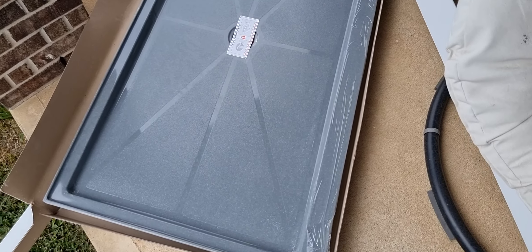You can see the waterproofing flange here — also called a tiling flange, those names are synonymous — and it goes all the way around the base. There's a curb here, and the curb does not have that waterproof flange. Your wall system comes down, and the base sits about an eighth to a sixteenth of an inch off the studs on all sides, so the tile or wall material lands right about there, whether you go with tile or Onyx for the walls.